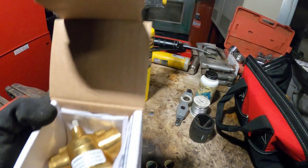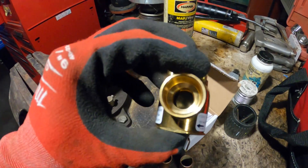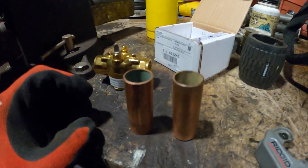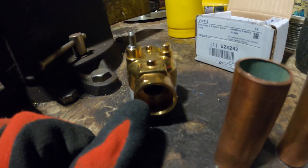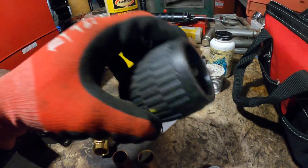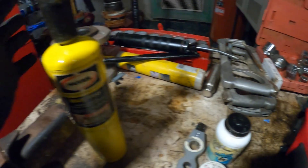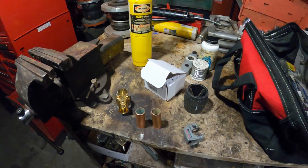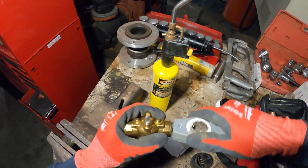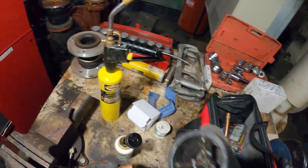Excuse the noise, guys — we got two absorption chillers working right now. I'm going to use this vise to prep everything. I got a brand new zone valve — this is three-quarter inch, a brass valve, two-position, two-way. I got two pieces of copper. We're going to sand the outside of our pipe and the inside of our fittings, and also deburr the inside and outside of our pipe. We're going to use 95/5 solder with paste flux, and map gas to torch everything up and solder these valves.